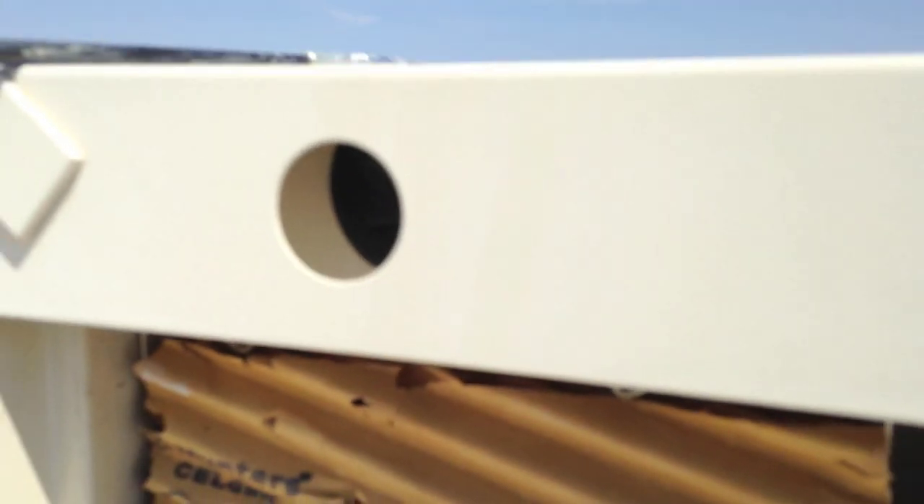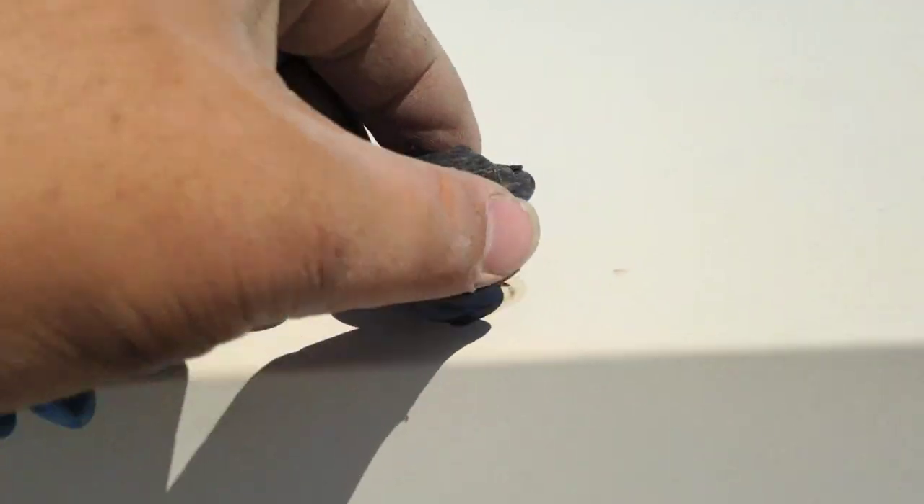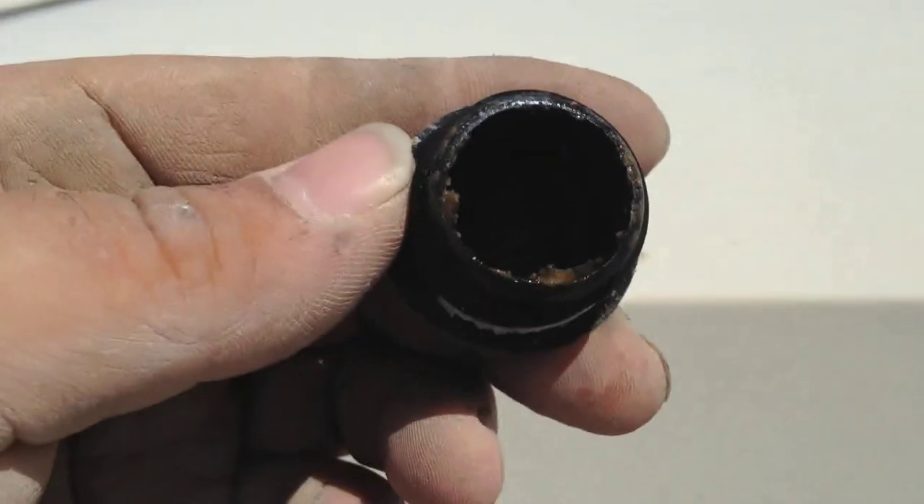So to clean the drip plate manifold water line, come to the other side of the unit. There's a little rubber plug here, and inside there's a bung that we gotta take out. There's all kinds of bugs in this unit. I got this bung plug out — it's all full of debris. I'm gonna shoot water inside there. You can see how clogged that pipe is. I'm gonna blow that out with water first — turn the pump on and let the water blow most of that out.